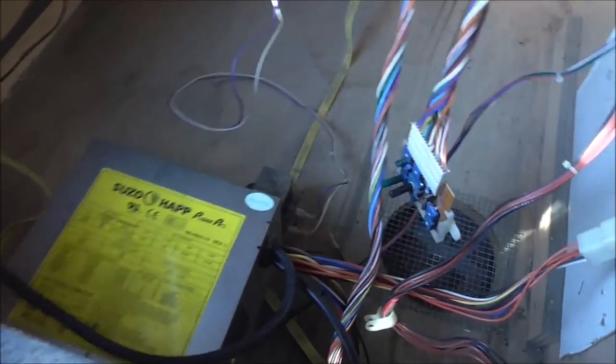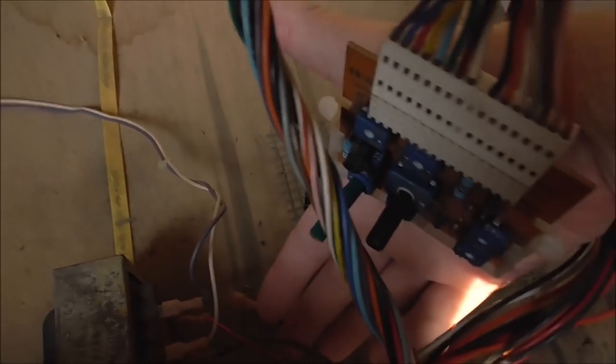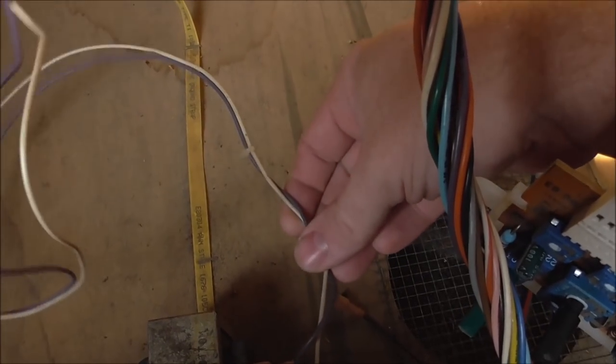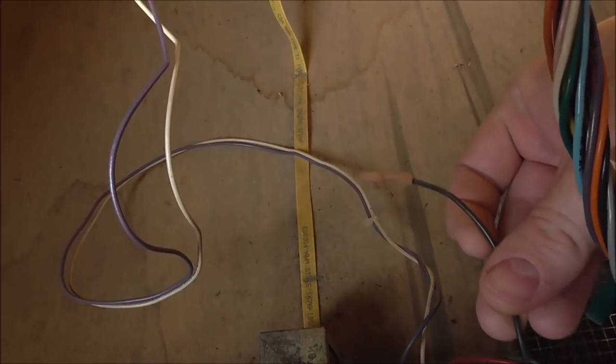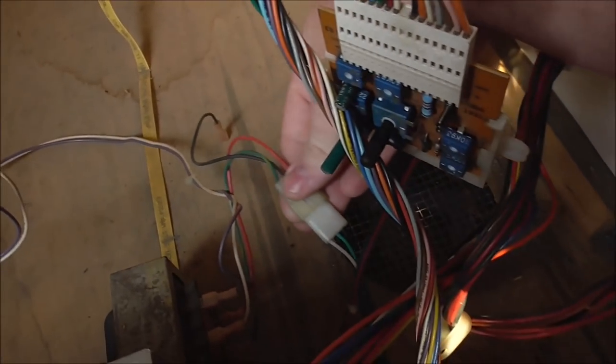But with that said, I just noticed something interesting. I look down here. I've got a green and a red wire going to this transformer, the isolation transformer. And then these come out of it and provide the power for the monitor. Some monitors need an isolation transformer, some don't. Okay? But why do I have a black wire?